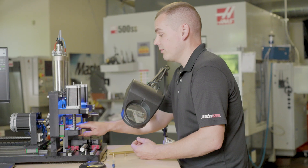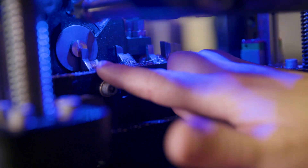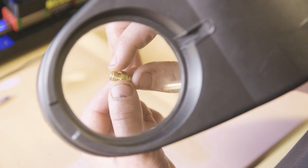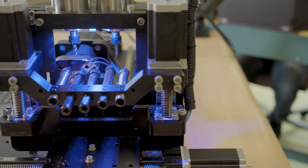Down on the lower gang here I have room for five stick tools. You'll notice I've got a cutoff tool, facing tool, and my threading tool, which is what creates the threads here. You can do any type of conventional lathe threading that you would do on any Swiss machine right here.